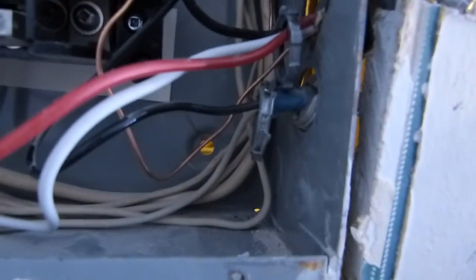The bathroom was also built in the 80s. None of this was ever designed, approved, or inspected to be here — I guarantee you that. There is no evidence of plumbing inspection ever being done on this. And a plumbing inspection is just one thing — what about the electrical inspection? How was it put together structurally? Is there evidence of mold? This could be a major source of discomfort and expense — asbestos remediation, mold remediation, ripping everything out — this could be a $10,000 hole in the budget right away. And we discovered it just based on a quarter inch of blue jacketing at the corner of the breaker panel.